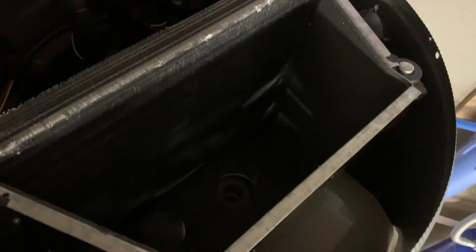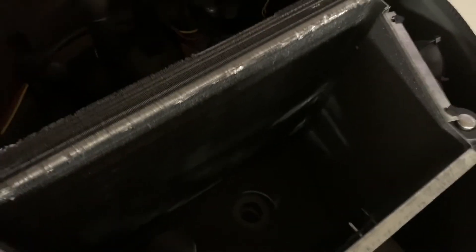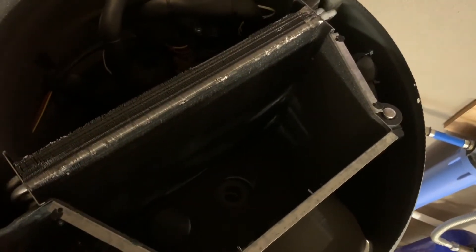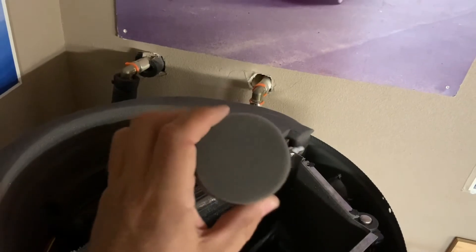As you look inside the unit it's a little dark, but there's some foam inside the heat pump at the bottom. If you reach in, there's a circular piece of foam right in the center — just pop that out and you can see the bolt right there in the center. That's the anode. You've got to put a wrench on that and get it out, but because it's in the middle of the heat pump you'll need a long extension.